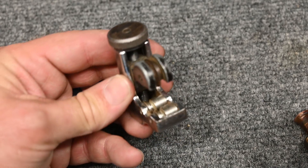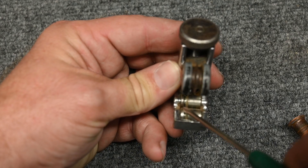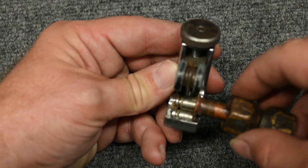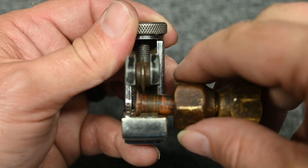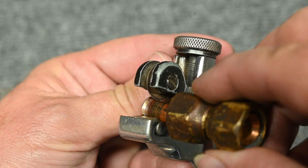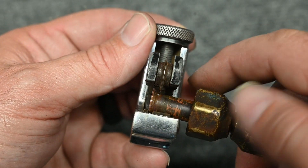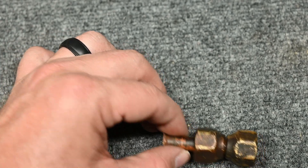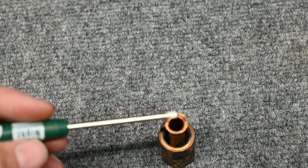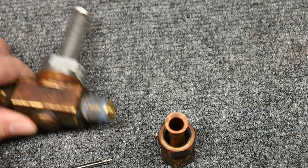We're going to be using tubing cutters. What a lot of people don't know is that our tubing cutters have a groove right here — the purpose of that groove is to cut off these flares. I can put the flare in just like so, and as I tighten the blade down, the blade is right behind that flare and I lose very little copper. So I can cut this flare completely off and make a new flare. If I make the new flare correctly — deep enough with the proper tension — it's not going to leak. Not over-flaring it or over-squishing the copper when we make the flare, and not over-tightening it when we tighten it together.